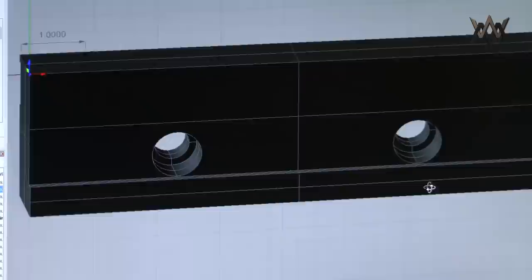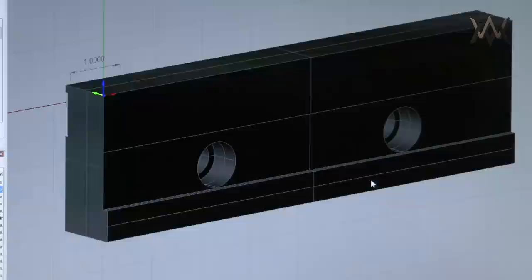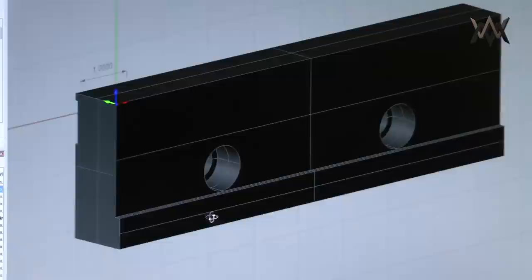And that's a little bit tricky because the gas block itself needs to be perfectly indexed or rotationally aligned with the 12 o'clock position of the barrel, or else obviously the front sight is going to be canted. We can't have that. So how are we going to do this? All right, so I designed up another fixture to hold the barrel and index it.